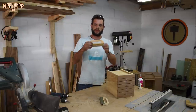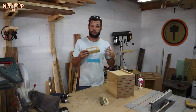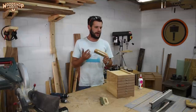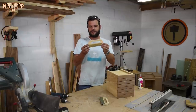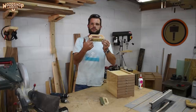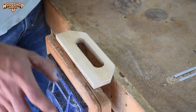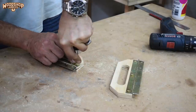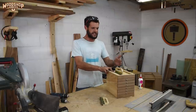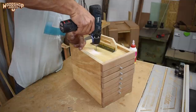This is pretty much what the handle is going to look like. It's not ideal — I would have preferred a store-bought handle but unfortunately I couldn't source one in time so I need to make do. The handle itself is just a piece of half inch or 12mm plywood that I drilled two holes in and removed the segment in between with my jigsaw. I then fixed a piece of piano hinge to it, and it will be attached to the top of the box. The reason for the hinge is that I need to fold the handle flat so I can put the box in the unit.